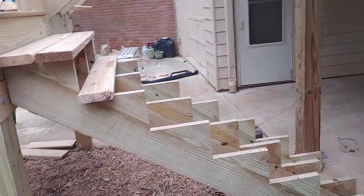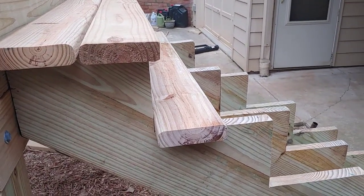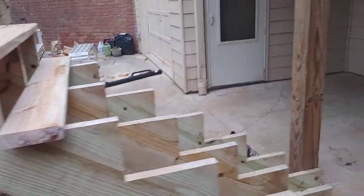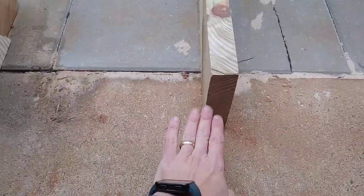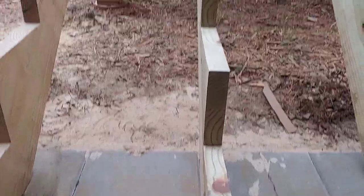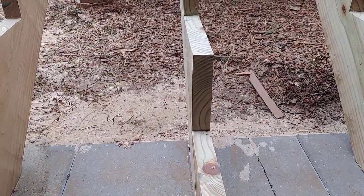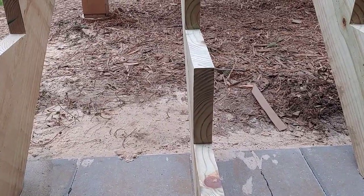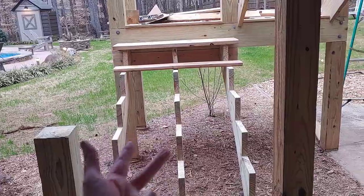You may have to adjust for the top step because of the difference in rise for your boards — a smaller one at the top and then the bigger inch-and-a-half here — and at the bottom remember you may have to adjust your template because you don't have a tread to stand on, so it's going to be a little shorter. Regardless, all of these end up at seven and a quarter inches in height when you start walking up them, because I've made all my adjustments. That's how you cut your stringers without being confused like I have been. Thanks for watching Swimming in the Deep — like, share, and subscribe.